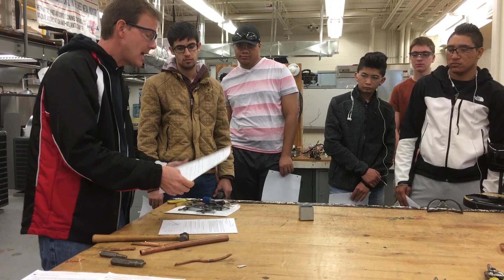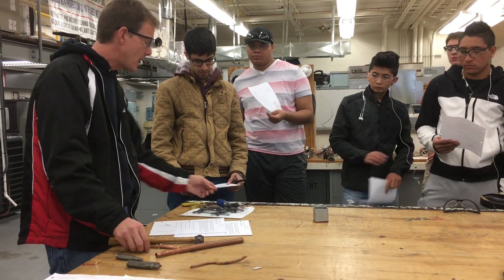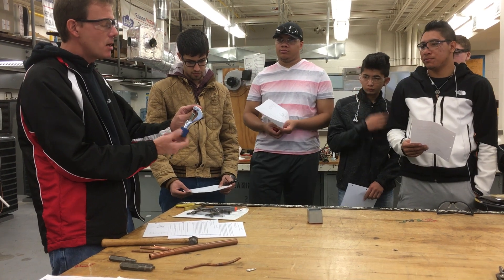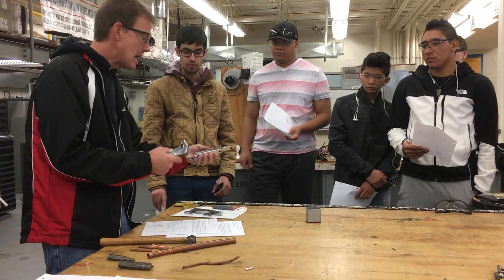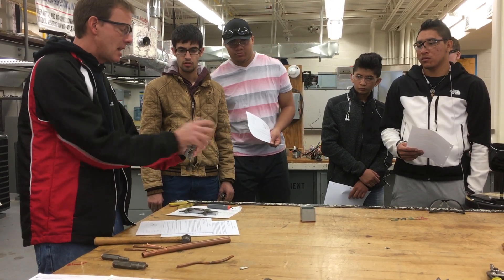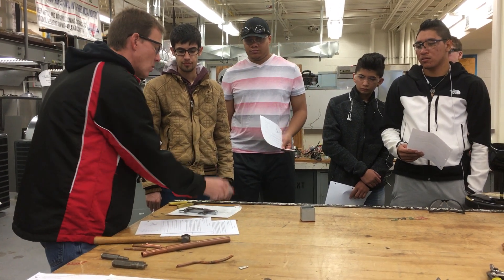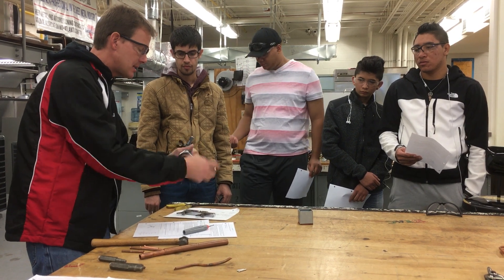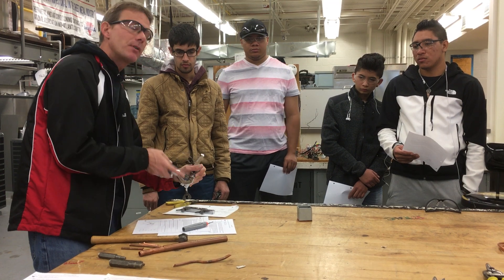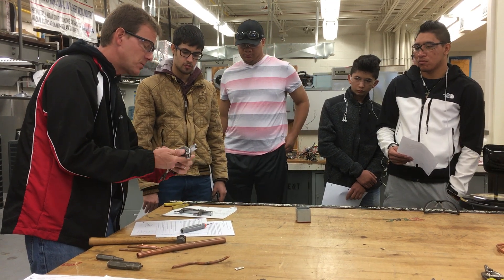The handout shows you'll be practicing first with quarter-inch pieces. You'll need to slice off the flare using the split-roll cutter, and because it's quarter-inch it's going to be hard to hold, so I'd advise using the block to hold it. Put it in the block — you don't even need to tighten it up — and just slice the flare off, sort of like what you did in the first project. Then we're going to use a different deburring tool to ream this out, because I don't need to be as conscientious about the deburring for a swage as I did for the flare. With a flare you had to be critical about deburring.